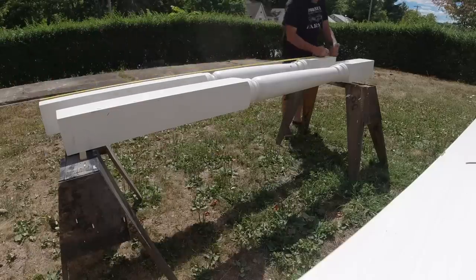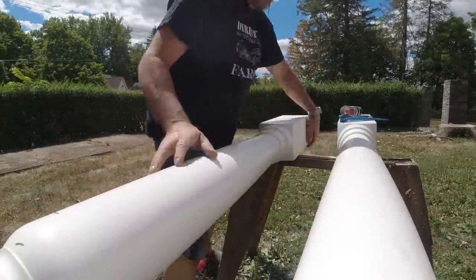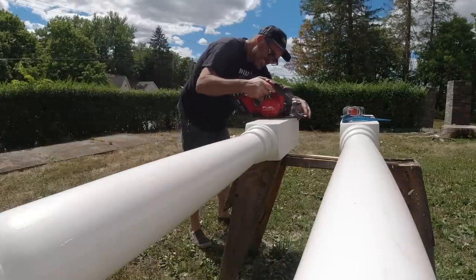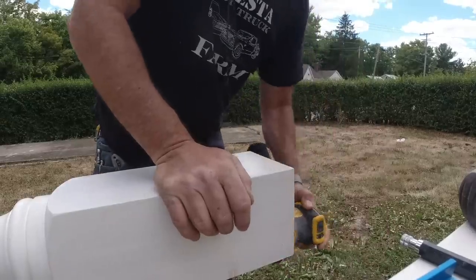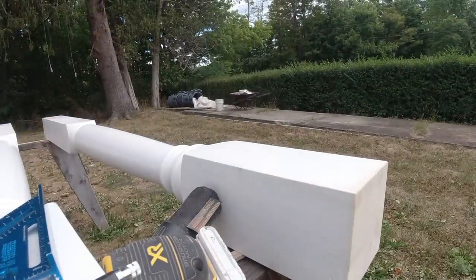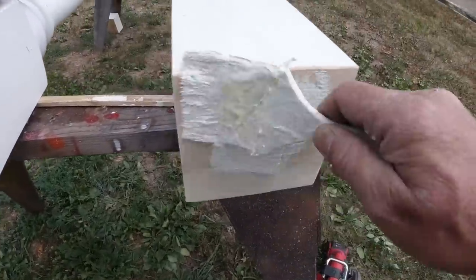These posts are 96 inches tall and it's important that each one is fitted in its exact section. As hard as I tried to make the porch level in every aspect, there are parts that are not perfectly level. The posts go from 94.5 inches on one side all the way around to about 92.5 inches on the other — a 2-inch discrepancy from pole number 1 to pole number 10.